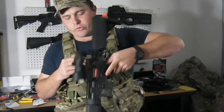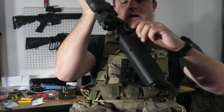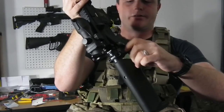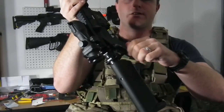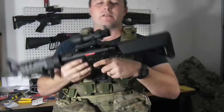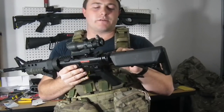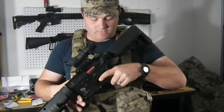The only issue that I had with it was this pin — you can see it comes right out here, just unscrew it. Over time this thing was backing out the other day. It didn't back out two or three threads or anything like that, it just got a little loose. Put a little Loctite on that and it's going to seat it right in there. You're not going to have any issues.